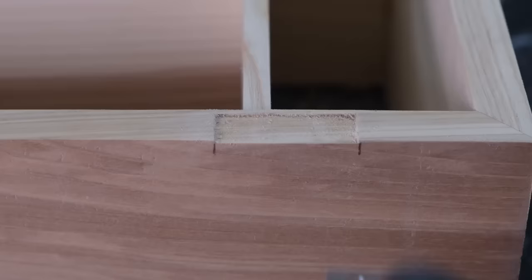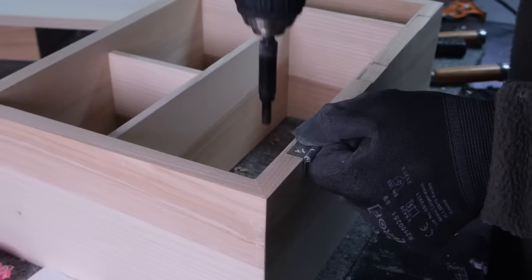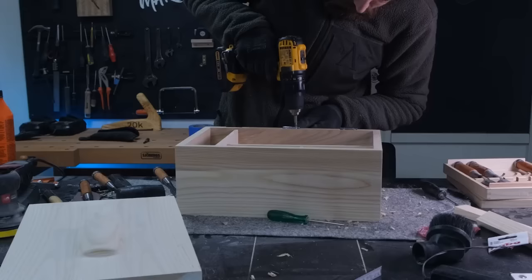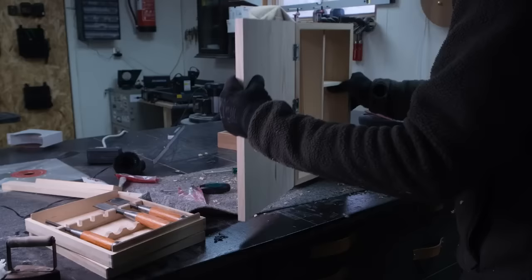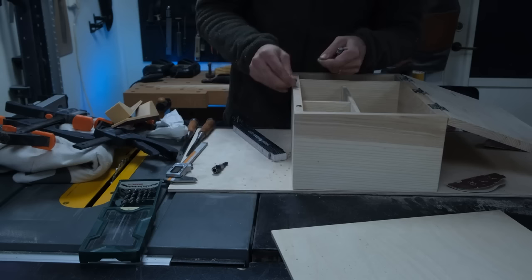So I went with the basic hinges instead. I chiseled out some pockets for them to sit in, used a self-centering drill bit to pre-drill the holes, and then attached the screws. Basic as possible. I added some magnets to hold the door as well, since I want it to stay closed, and the hinges I chose won't keep it closed.